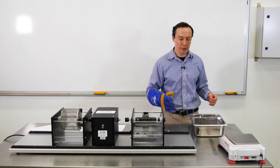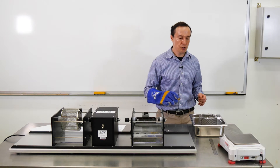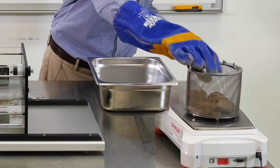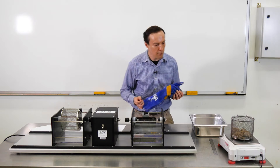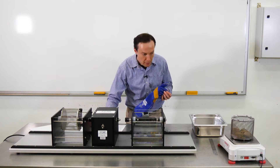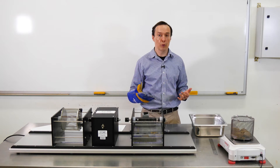It's been six hours, so we've dried our samples. We'll now measure the mass of the drum together with the dry rock. The recorded mass is 1244.6 grams. Next step is we're going to repeat the procedure and do the second cycle.